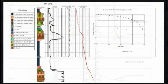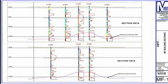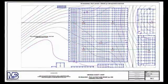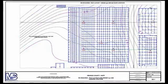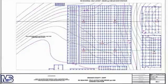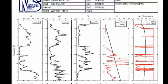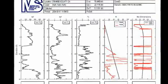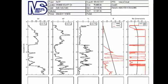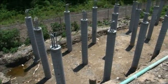At the end of each workday, the project supervisor downloads and reviews all of the pile logs created by the data acquisition system. These logs are checked against the third-party inspector's handwritten logs, then both sets of logs are emailed to management for review and filing. DeWall piles are designed to have tensile and lateral capacities equal to or in excess of those required for the project. Morris Shea uses locally licensed, registered professional engineers to perform the complete DeWall pile design, including pile reinforcing steel details. DeWall piles are always designed to satisfy all building code requirements.